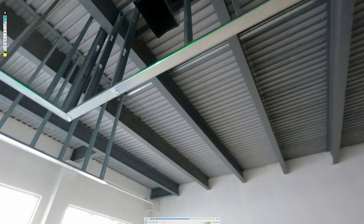All right, so you can see the fishtail right here, okay? Basically, what you're doing is you're cutting the center of the track up the middle, 2 inches up the middle. And yeah, you're gonna put screws in there and there to prevent it from moving. It's a pretty straightforward practice for doing your track. Okay. Get the other one done.